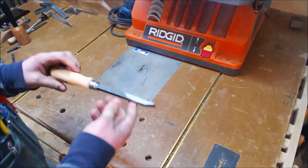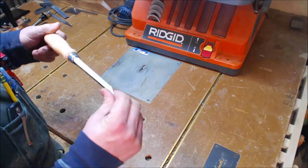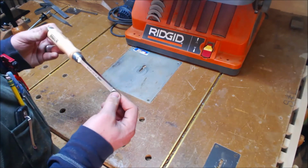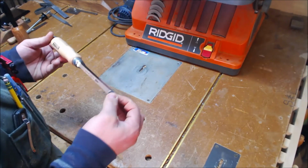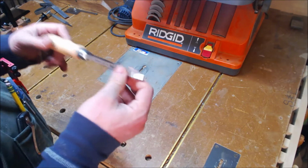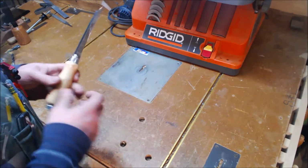you can do the same thing with a mortising chisel or even regular chisels. You're gonna have to sharpen edges quite a bit, as we are chopping into end grain, so it will be pretty tough on chisels. So a mortising chisel can do the same thing.